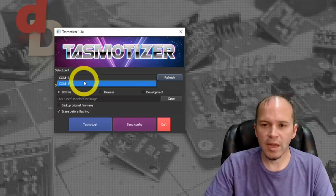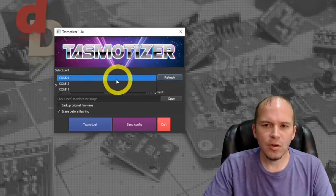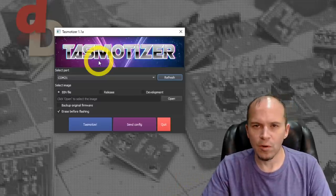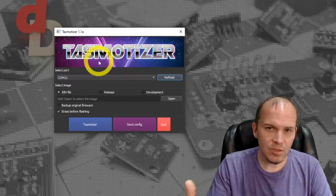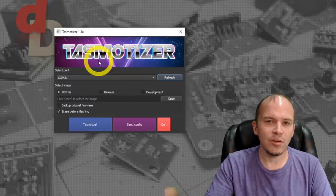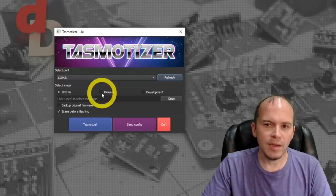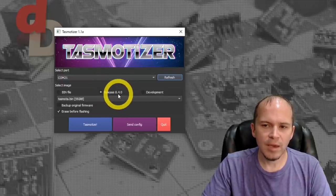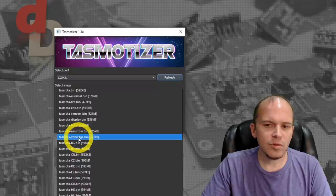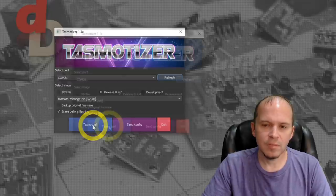I get my little tones when I plug in a USB device. Hit the refresh button and you'll notice you get another COM port - that's an easy test to know if your drivers are working. If you don't get an extra COM port, you either have something shorted on your USB flasher, your USB cable is bad, or you don't have the drivers loaded correctly. We're going to load the latest release - at the current time 8.4.0.